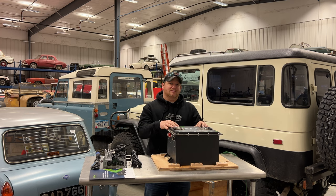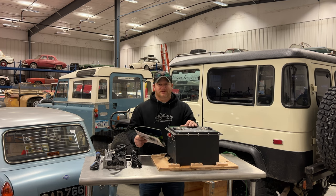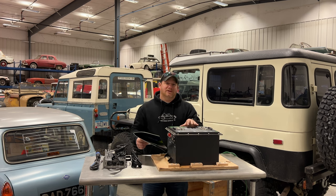It's pretty amazing how much power you can get in such a small size now. This particular battery has about four kilowatt hours of power, and these golf cart lithium batteries are available in 36, 48, and 72 volt. The reason I picked this particular battery is it has the same capacity as the highest capacity 48 volt battery they have, and 36 volt inverters are much cheaper than 48 volt inverters. So I get the same amount of energy storage for a cheaper cost.